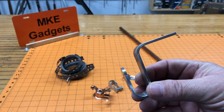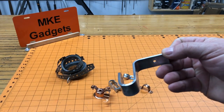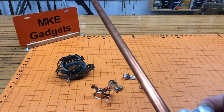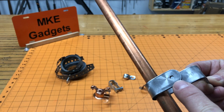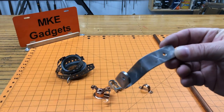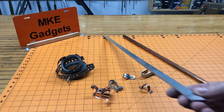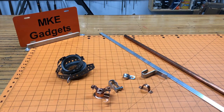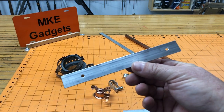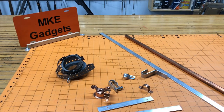So what I came up with is aluminum bar — it's an eighth inch thick, three-quarters of an inch wide, six inches long. It has a screw hole so I can screw it to the ceiling ahead of time and then come and lay my copper tubing in there. I don't need any fasteners or any tools in my hand. I do have a small threaded hole there and if I want to add a bolt in the future I can. It's aluminum so it won't rust. I did a little engine turning, well, because I could. So I went to my mega big box store, bought some aluminum bar, and cut it a little longer than six inches. With all the bars cut, we're gonna go over to the Bridgeport mill to drill these holes and then mill a contour.